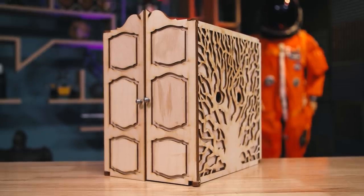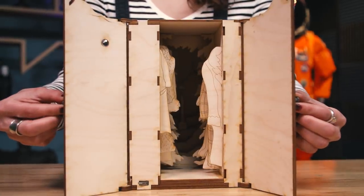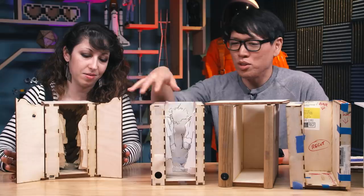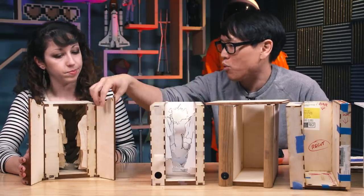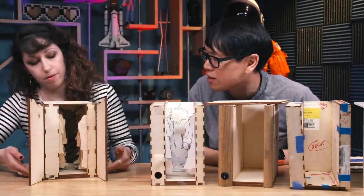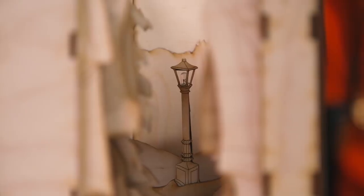There's now an actual entry so you can interact with it — you open these little doors and you can kind of go into the depth of the scene. Doors aren't a part of the original design — you designed a hinge here that works as a hinge for the door. It's embedded into the top and bottom pieces — just a simple hinge mechanism and the doors lock into those. The doors also activate a switch which turns the lighting on and off. I built a little micro switch into it so once the door closes, it turns off the lights inside.